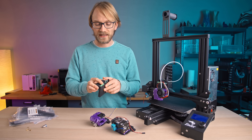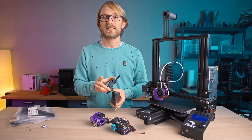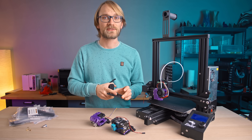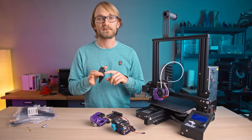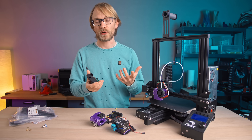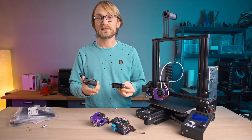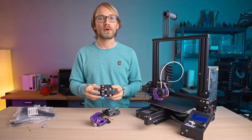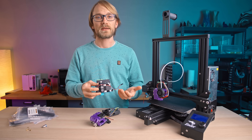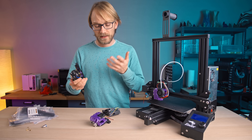As far as voltage goes, I think these connectors — both the screw terminals and the pin header — can officially take a couple hundred volts. But I would call it quits at 48VDC and I would definitely not hook up mains to it, even though the connectors theoretically can handle it, because all the connections are exposed at least when you remove the mobile plate. 48V is going to be a bit of a tingle, but generally still considered safe. There's also no pre-shut-off or any means to turn off your high-current load as you disconnect, so if you disconnect a router spindle or even a high-powered hotend while it's still powered up, you might get some arcing across the header. You also need to manually turn off any stepper motors routed through the mutant before you disconnect it, because stepper drivers don't really like it when you just yank the connections apart.